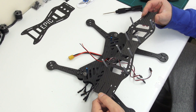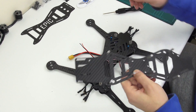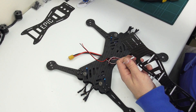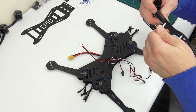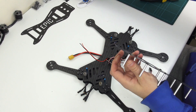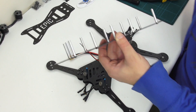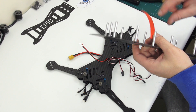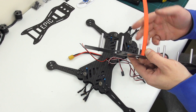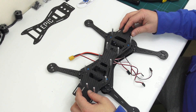Now we're going to add our main plate. This is what's known as a clean plate. This actually sits on those rubber isolation mounts, away from all the vibrations from the motors. As you can see, I've already started putting the large spacers in — I've just got to add three more. Again, using those 2mm hex screws, just attach them onto the frame as you can see. A lot of people like to customise the colour of their quad. A handy thing to do with these posts is to add heat shrink on. You can get heat shrink in many different colours — simply slide it over, cut it and heat it, and voila, you've got coloured posts. This clean plate simply places over the blue stopper posts onto the rubber isolation mounts.